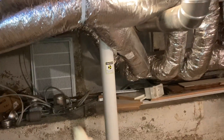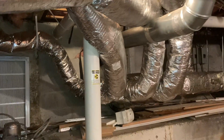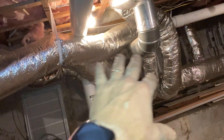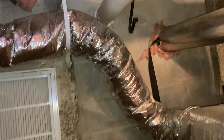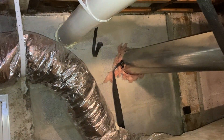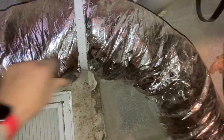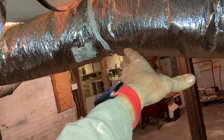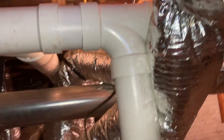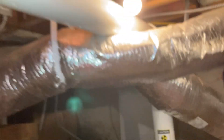One side note: when we came through here, it's like a crazy spider web of HVAC, and it actually faked me out for a second — I thought I can't come through there. But then I realized I could. All I had to do was cut these little flex duct pieces and they move around for you. They're not rigid. So keep that in mind: make the flex ducts move for you rather than trying to snake four-inch rigid PVC pipe around everything.